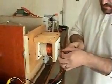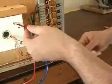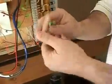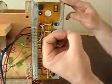On the new wheel, this is the same exact thing — this is a coil. Five strands come out one side, five strands come out the other. Each strand on one end will short together because it's the same wire. On one side of the coil, the five strands coming out are shorted together — you burn off the coating and short them all together; that's common because they have a common purpose. The other side goes through the circuitry through these diodes and resistors to the transistors. The transistor basically acts as a timing switch: when a certain condition happens, the switch opens; another condition happens, the switch closes. So this is basically a switching system.